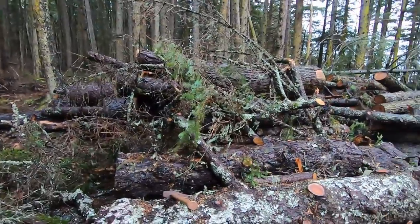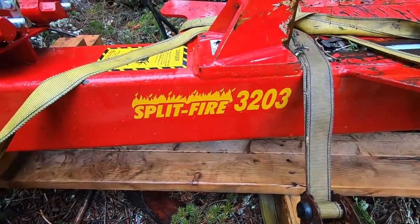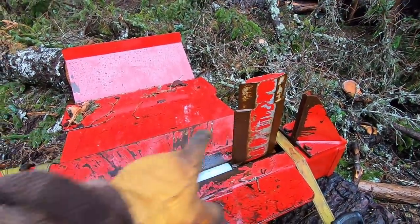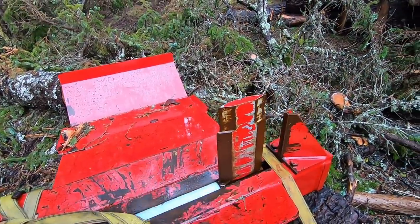Once you have the wood all bucked up, I luckily have a tractor so I can pile all my wood up, let it dry for a season, then cut it into rounds and let it dry again, or split it from there. There are two basic ways to split. My preferred method is with the Split Fire 3203 — it's a tractor attachment. I take my backhoe off and hook this up. It's got a double blade, so you put a log on it, it splits one way, then you put another log on the other side and split back. It cuts splitting time in half.